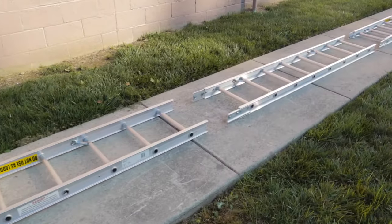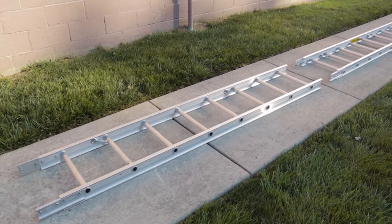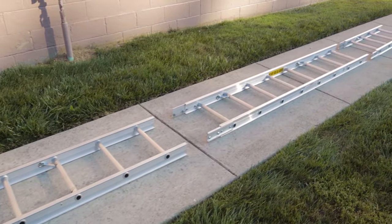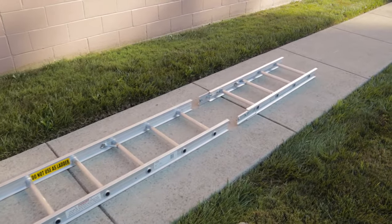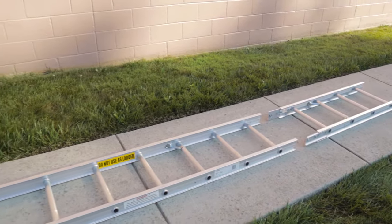Gather the 4 pieces of track and lay them on the ground. The 8-foot base section with feet attached should be at the end, with the two additional 8-foot track sections above it, and the 4-foot section at the top. You will know the track is facing the correct way if the off-centered rungs are closer to the ground. Please note, the track will not fit together if any of the sections are upside down.